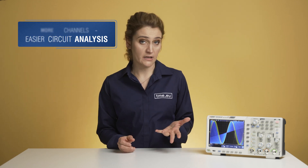Number of channels. The more channels you have, the easier it is to observe how the signal is propagating through the circuit — it is easier to understand what is going on in the system. If you have four channels like here, make sure to use channels one and three first.